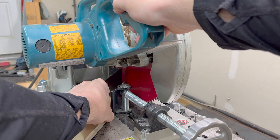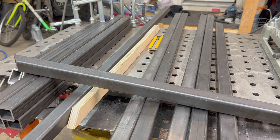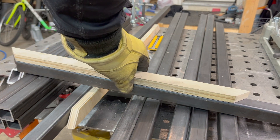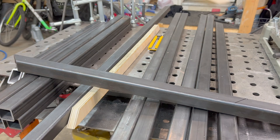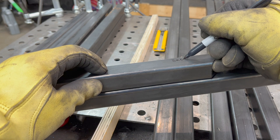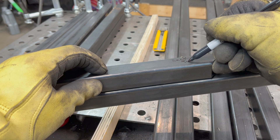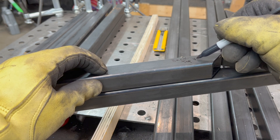So I set an angle, make my cut, then set my next angle and make that cut, and so on. I also use the templates to mark the length of each piece — this again just ensures that all of the chair's parts are going to line up nicely. Once I've made a cut, I mark each miter with where it's going to be, so it's not going to be confusing in the end. Some of the angles are fairly close, so once it's marked, I know I'm not going to mess it up later when I try to start to weld.